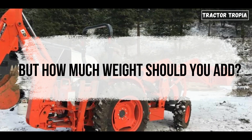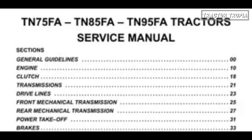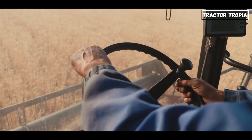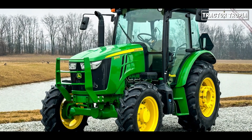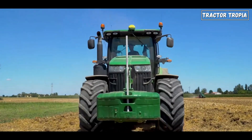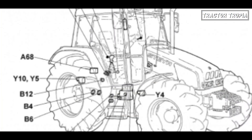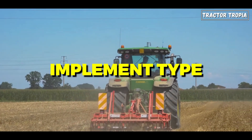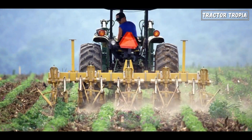But how much weight should you add? Knowing how much weight to add depends on factors like checking your tractor's manual, considering the type of job you're doing — soft or hard ground, pulling heavy things, or just driving fast or slow — and understanding if you need more weight in the front or back. The size of your tires also matters. Every tractor model and attachment has its own weight requirements, so consult your tractor's manual. Factors such as soil surface, implement type, travel speed, and tire size must all be considered. One size does not fit all.